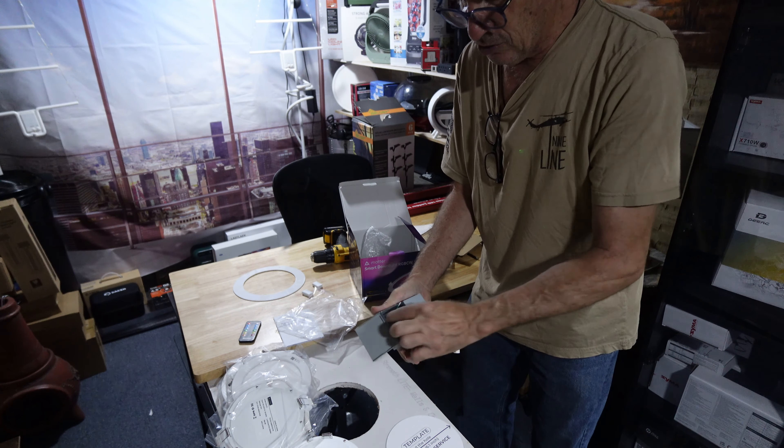There's a simple hookup by connector. You're given four lights and four connector blocks, and you simply screw down your connector blocks onto your ceiling. Open up the cover and take out the connectors — your neutral, load, and ground. Looking from the top, you simply slide them on and lock into place. Then grab your plug and plug in by fitting for the design and twisting.